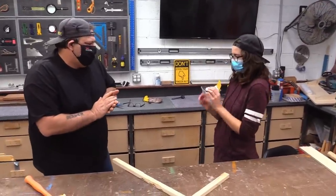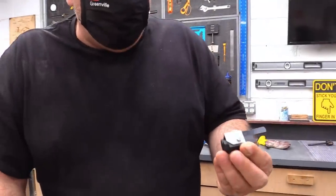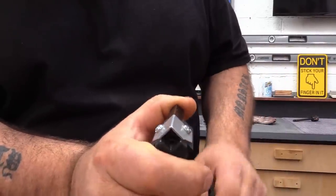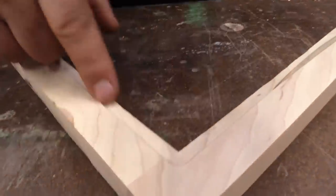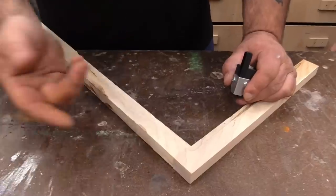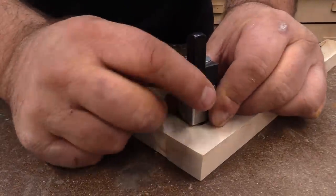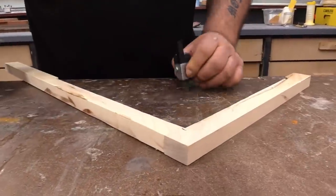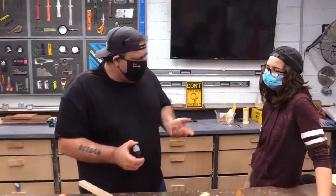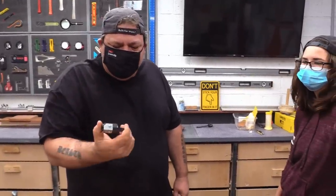So we've been talking about tools, and I found this little doodad. This is one of those convenient tools I always forget about — something I got off Amazon. If you look at the bottom of this, you'll see it has a little lip and there's a 90-degree chisel that comes out of it. It is literally for taking the corner off — let's say you did a frame and you want to inlay some eighth or quarter inch material into the frame and you routed it out afterwards. You're left with this little round-over in the corner. You try to come in there with a chisel and get it just right, and that can be a little tricky. Well, this makes it super easy — you just put it right in the corner and bop it. Then you come back and clean that up with a chisel and you're done. Super simple. It's one of those crazy little convenience tools. For eight or nine bucks on Amazon, it's just nice to have around.